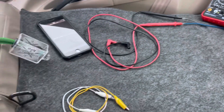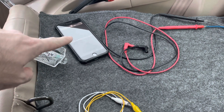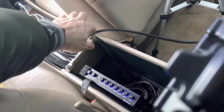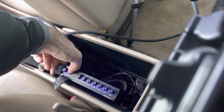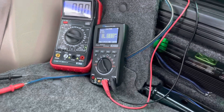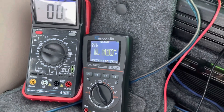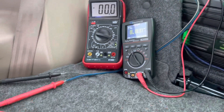We're back in the car. We're going to do a little test here — a 40 hertz, 0 dB test tone being played. I've got my RCA run that goes into here. I've got a bunch of extra slack so I can do it from outside the car if I want. I'm going to play with my output voltage here, and we'll check first the voltage to make sure it's a clean output. I have a splitter, so it's going to the amp as well as to the meter.